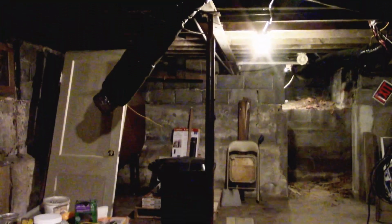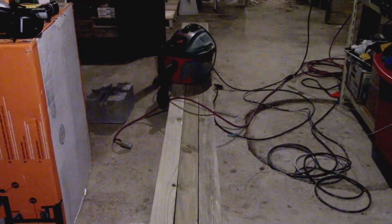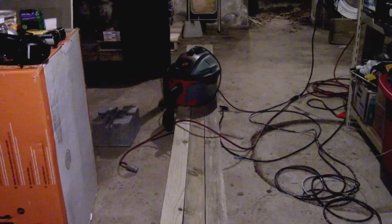Now that I got the path clear, right through there is my path. Now I can make a prop for one side. I'll use the jack for the other side, and I'm going to use the brackets to attach these to the joists. I also have to cut it to length, so measuring things out, get that going. Again with this laser measure, gotta love it.